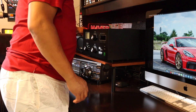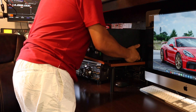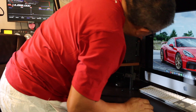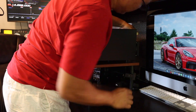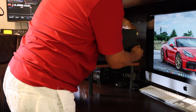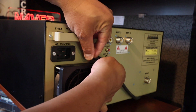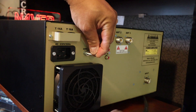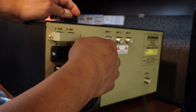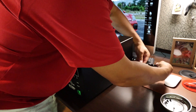I'm going to move my amplifier and put it on the table. My house is so small that this is actually my bedroom operating as a radio shack — my radio station. Slowly moving this out of the way. I disconnect the power cord — I don't have 240 set up yet — then disconnecting my RCA cable and the ground. I'm using a six gauge wire for my ground, and that's grounded to the radio bus to the station ground outside the window.